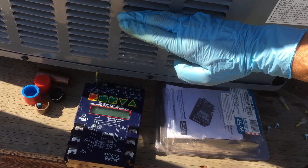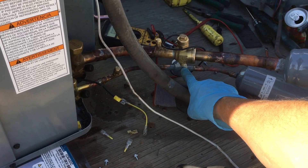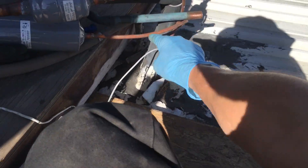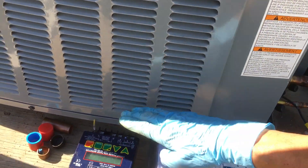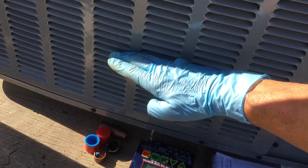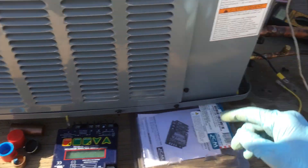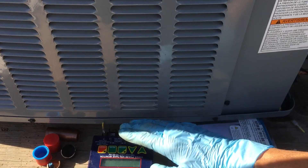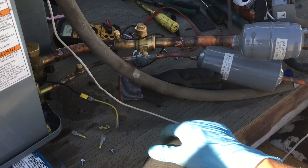I never got to make the video showing when subcooling is low — you can actually see how low the liquid refrigerant falls on the coil to where it flashes and you can see bubbles going through the sight glass. Remember, liquid stacks up from down into the expansion valve and backs all the way down the line. If you're supposed to have, say, 12 degrees of subcooling, that means your condenser along those rows would be back-stacked and filled with solid liquid refrigerant with no bubbles. Because of the size of this filter, it drained the condenser coil and needed to be compensated for.